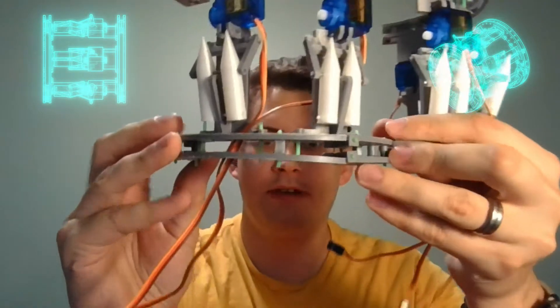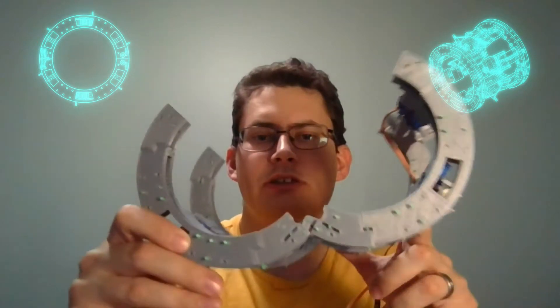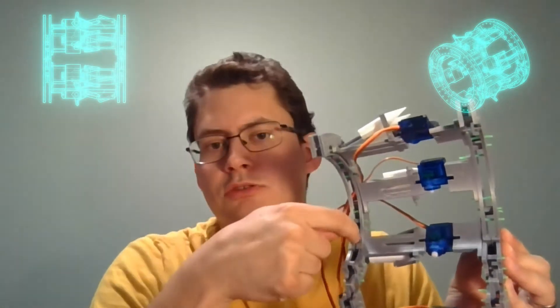I found out that the gaps I have down here are too thin to really snake the servo cables through — I'll want to fix that. I also found out that trying to do the pins or even screws straight this way is a bad idea. It's just too hard to fit a small screwdriver, or pair of pliers, or anything in between all of these cracks to get at what you need and pull it out and put a new one in. Way too much hassle. So for the next design, I'm going to have the plates overlap with this frame and screw straight down into it — that should work much easier to maintain, and should still offer the same strength.